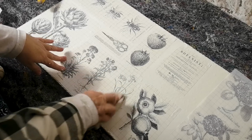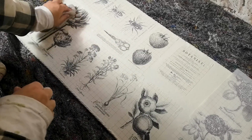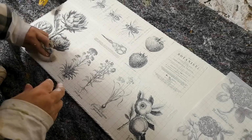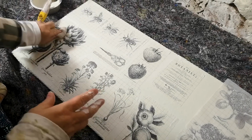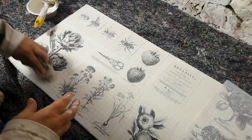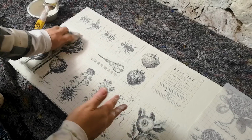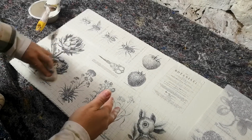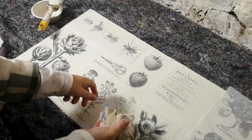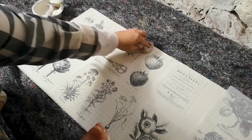Yeah, I think the only thing I can think of where people don't use them is because they put them on the wrong way round, or they're trying to put them over a decorative finish on their paint and they're using top coat and it hasn't worked out. If I was you, I would just do the bog standard paint first. Two coats of your base coat, one coat to apply your inlays. Apply them with water and a cloth like this. When you go to take them off, it's exactly the same thing. Apply the water, pull them away. That is it. There isn't any other mystery or mystic arts about it.